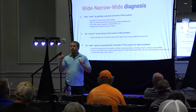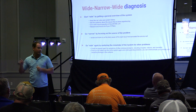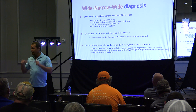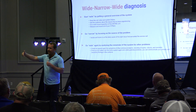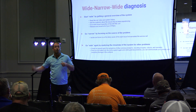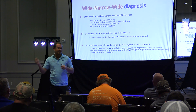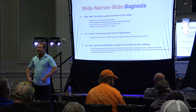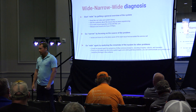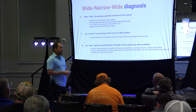You're paying attention: this has got an 80-foot line set — this falls under the long line guidelines. Let's look that up. This system is supposed to have a crankcase heater and it doesn't have one. Could that cause the compressor to fail? Sure. How often do we take it to this nth degree to make sure the compressor is not going to fail — doing everything we can before we even fire it up? Before we wire it up and fire it up, we do everything we can. Then you run-test it. There's a lot you can do before run-testing to catch problems first.